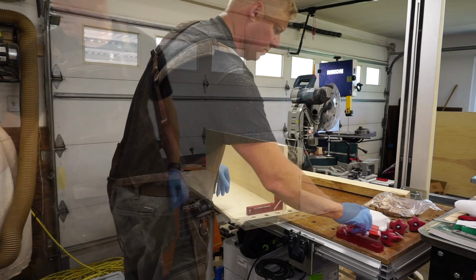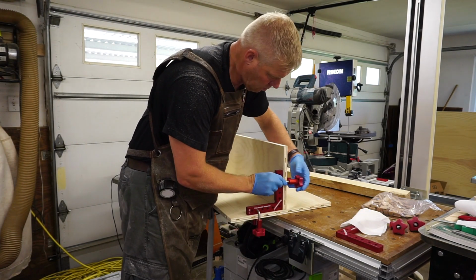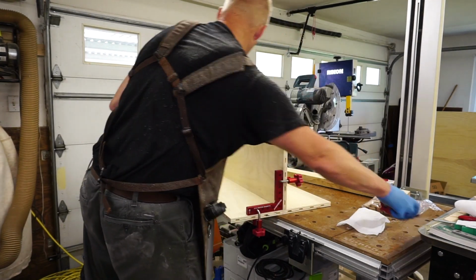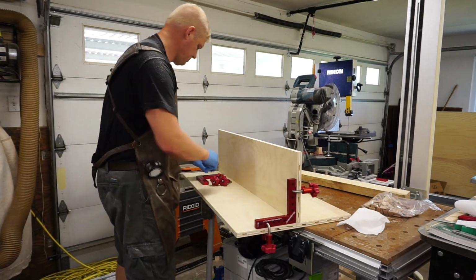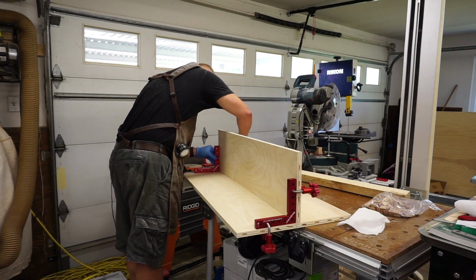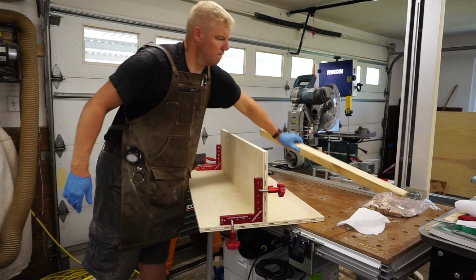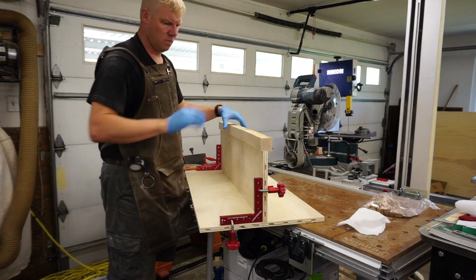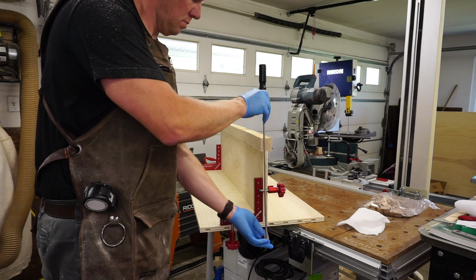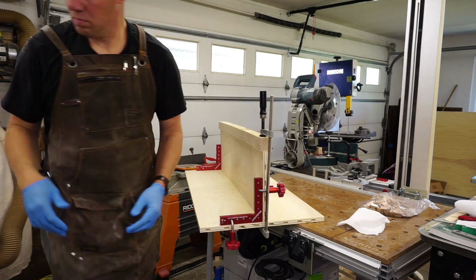When designing this piece, one thing that haunted me was the assembly process. It is something you really need to take into consideration when you aren't using pre-made plans that come with step-by-step instructions. I wanted to avoid using pocket screws if at all possible. I did not want to use wood filler to fill a bunch of screw holes knowing I was going to stain this piece. I finally settled on building this from the inside out, starting with the center divider and, of course, using the dominoes.